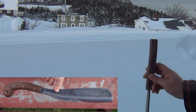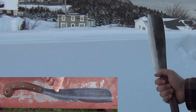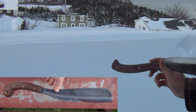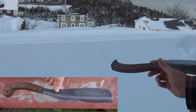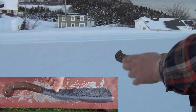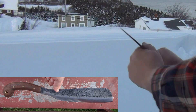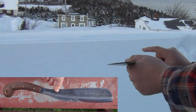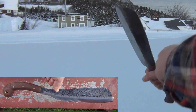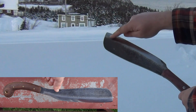I'll fully enclose the tang if the blade performs relatively sensibly in terms of the steel, and then I'll modify these scales to fit. The other thing I did was address the handle shape — the initial handle was fully round, meaning it was as thick as it was wide. That makes it very insecure because it's very easy to turn the hand in the handle. This handle is much wider than it is thick, so it's very stable in hand.